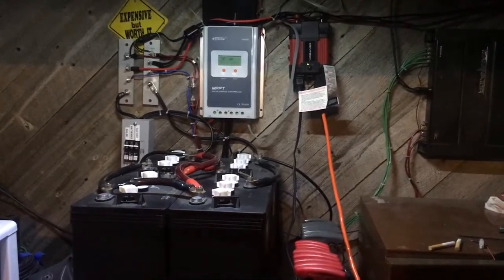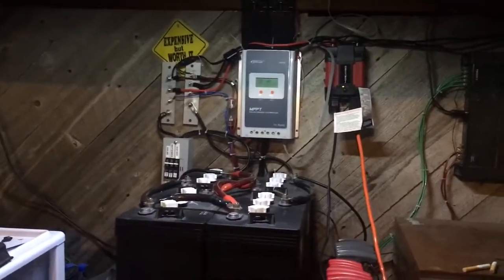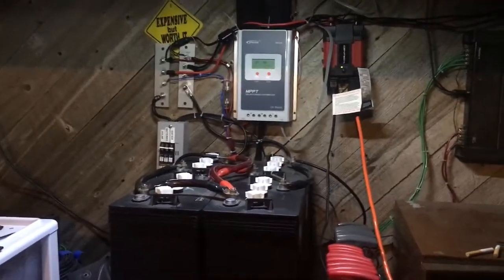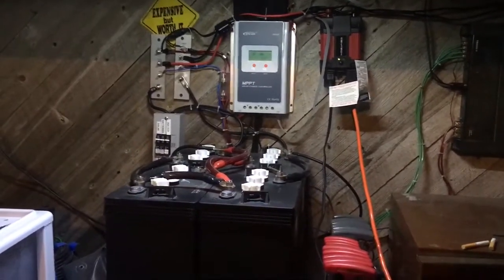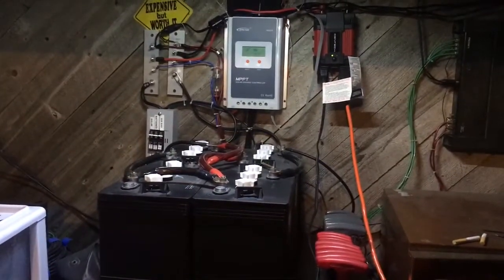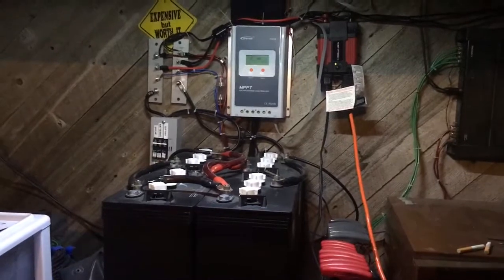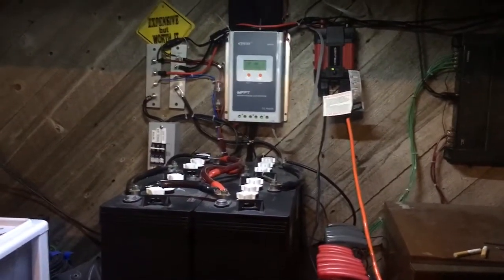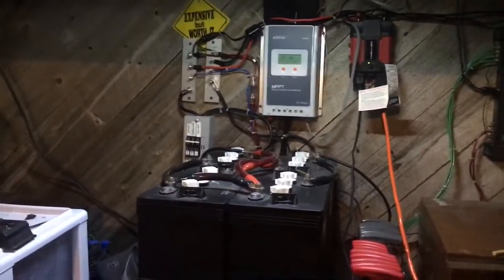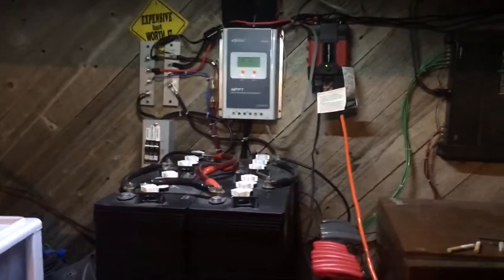The real question is: can your solar panel charge those batteries within the next day? Because you want your batteries to be fully topped off every day. There are so many variables on what a 100 watt panel can produce. Is it summertime or wintertime? Are there mostly cloudy days or sunny days? Are the solar panels angled correctly — too high or too low? Is the wire size big enough to carry all the power, or is the wire run too long? Do you have an MPPT charge controller or a PWM? There are so many variables that I cannot give you a simple answer.